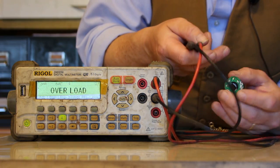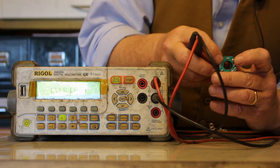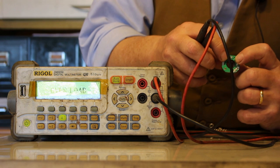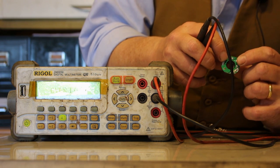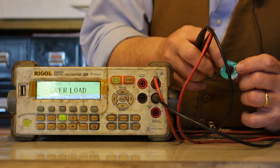So remember I said it just adds up. The two at 30 ohms are the separate coils. These two wires are the ends of the two coils and they're joined at the middle because that reads 60 ohms. So what I need to do is solder a red and a black wire on those two outer points — it doesn't matter which one's which.